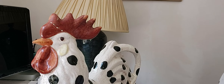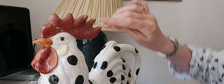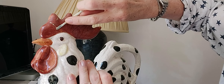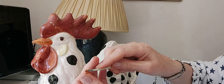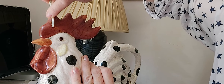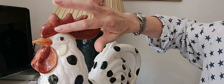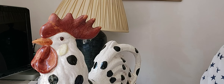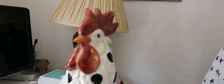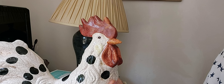As you can see we've got some slightly deeper cracks in here. With our little tool, just take a bit off and fill them in, then take another little piece. You can demonstrate filling without water on this side for comparison. This is going to take around 12 hours to cure and really harden, but 24 hours is even better, and then I can just finish off sanding ready for painting. I hope you enjoyed this video - please subscribe, like, and share, and I will see you in the next one. Bye!